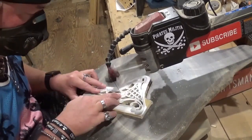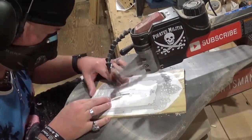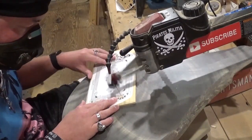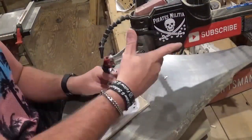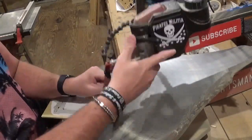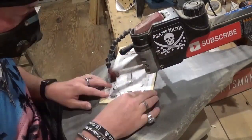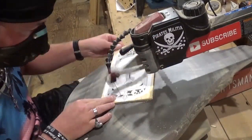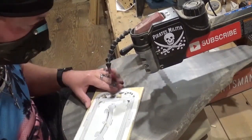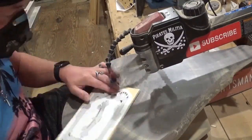I'm lost in my world of good music and sawdust. Once a scroll sawyer gets accustomed to using a scroll saw, they will eventually try a fretwork project — either corner shelves like we've done previously, or a style similar to this. Now we're cutting out the single layer of quarter-inch material that makes up the frame itself. Before assembly, I should mention I don't have the glass yet, but it does hold a four-by-six picture.